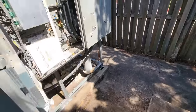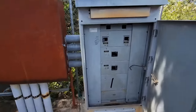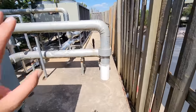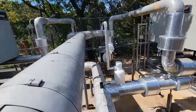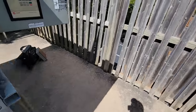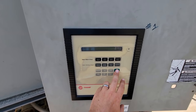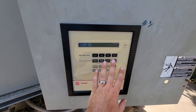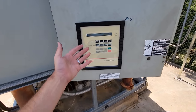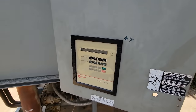Let me get my meter — we'll confirm voltage is dead. Okay, got the new board in. Give chiller one power. The idea is we can take that bad board and put it back in the old condemned one — hopefully because they've only got one circuit that sort of works, it'll save them as a spare. So far no alarm — we're good. Going to auto. I heard the valves calibrating — on a power-up you're going to calibrate your EXVs, and they did.